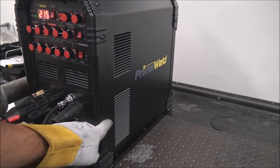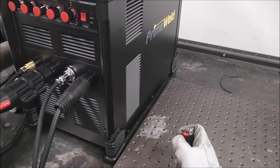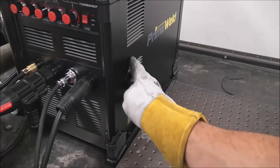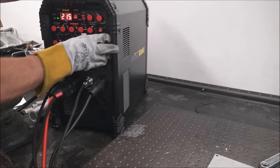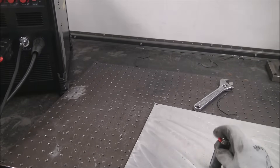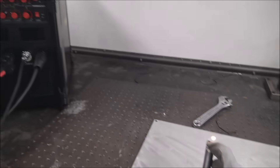This machine has pretty strong cooling fans which move a lot of air, and that's a good thing. But you want to make sure that you don't put it near where you're welding, because all that air moving out is going to displace your shielding gas and give you welding problems. So make sure this isn't pointed exactly at where you're welding, or come out a ways and put something to divert it. I thought that would have been enough to divert the air back there, but watch — I weld right here on this plate and it's still blowing the flame quite a bit. See that flame? So you've got to do a better job than that.